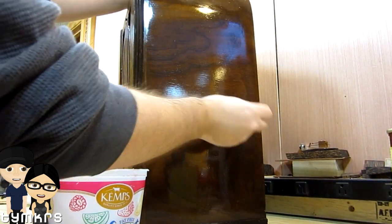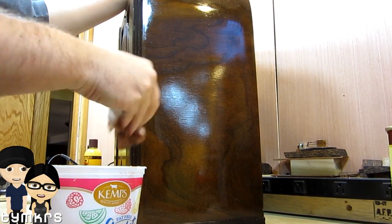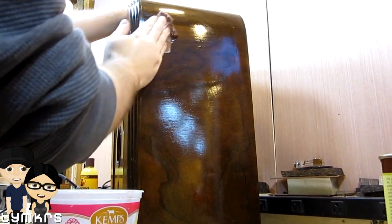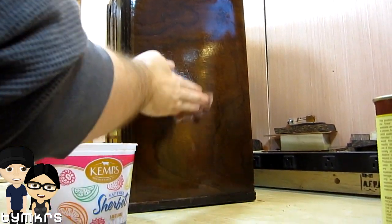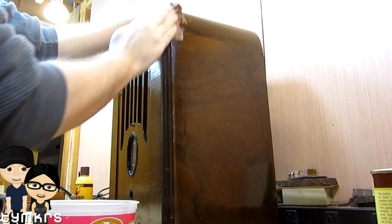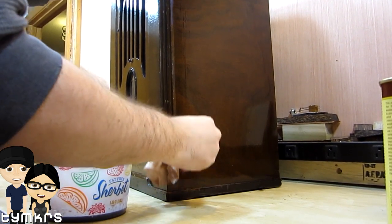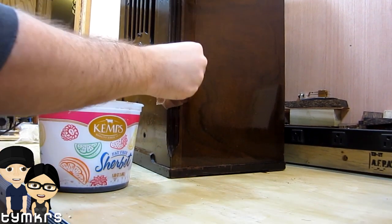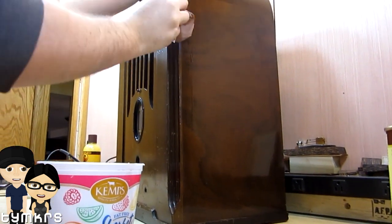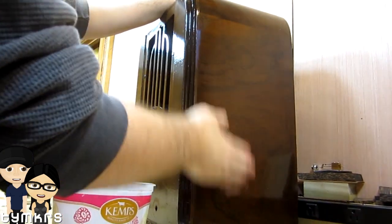So there's some water stains along the finish right there. I'm not sure there's much we can do about that. You could steel wool it. Steel wool is more for scratches that this doesn't work on. The cloth is not functional on those. So I don't want to go with the steel wool until I find a situation that I'm just totally not satisfied with. And being under the finish like that, the water, I don't know that this would help at all. We may have to use steel wool on these though, because there's some deep gouges. I'm really happy with how this is working. It's going to be beautiful.